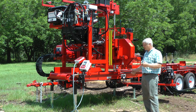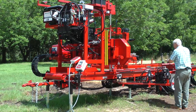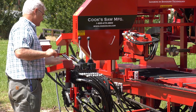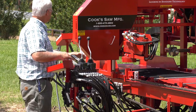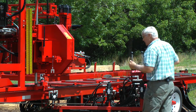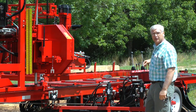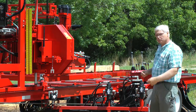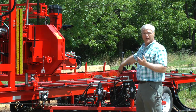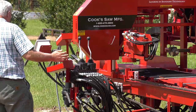If you have a special need concerning hydraulics, or something added — like the belt on this mill — once you have the hydraulics here, you can do a few other things as well. I want to talk about these valves particularly here. We have a pressure relief valve up on the main system, but in certain operations and applications — like grapples for lifting logs — we can put a pressure relief valve right here if needed. Or, if you have a bank somewhere else, it may have its own pressure relief valve built right in. Hydraulics have been around many years and there are a lot of features that can be added in.